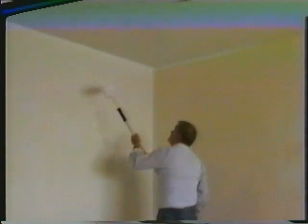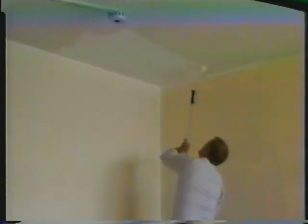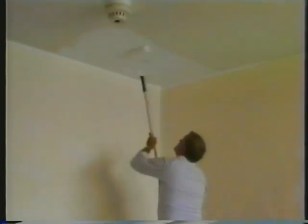When you come to roll on the paint, coat the roller thoroughly, then roll on the paint in just 2 or 3 quick strokes, then reload and paint the next section of the ceiling. Notice that you don't go back and forth over the same area over and over. This keeps the particles of stipple intact on stippled ceilings, and it keeps you from spreading the paint too far,